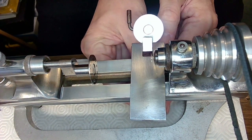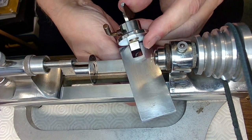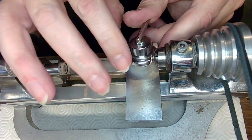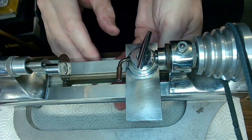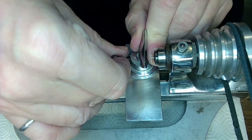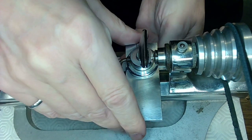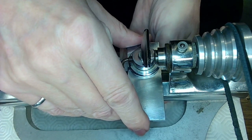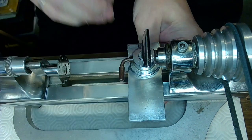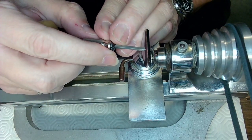Because I need to take the material off, I need to basically flatten the end of this like that. I did this last time. I just basically say the word basically a lot today, but just put that in like that and then put that in like that and then get myself one of my gravers that's super tight. So now I want to face this off.